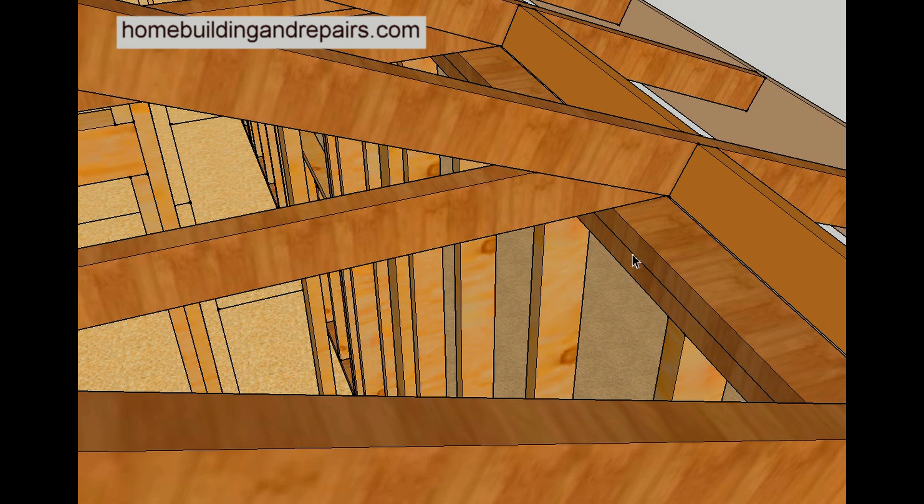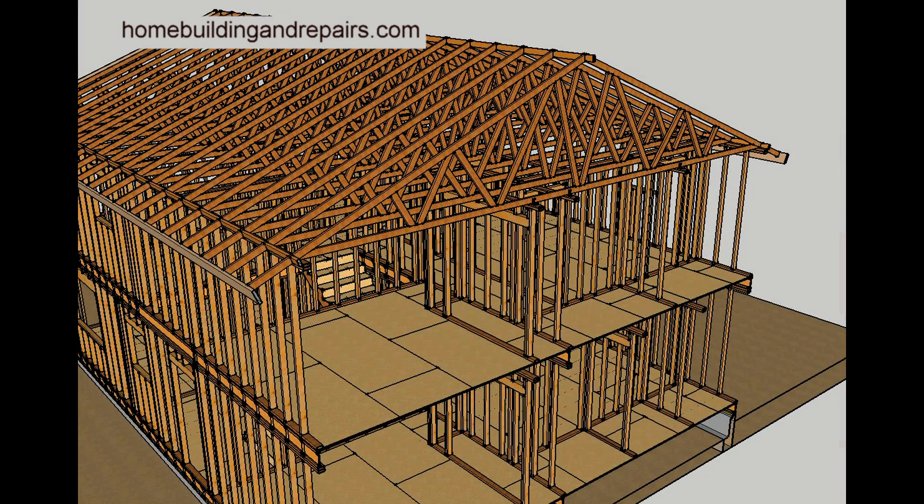So all interior walls need to be a little lower, and this would be specified on your framing plans. Here is a cutaway section of the framing. The roof truss sits on the exterior walls — these are the bearing points where the truss won't move up and down as much as it will in the center. We have the exterior wall, interior walls, and exterior wall. The roof truss sits on the exterior walls and the truss clips are used on the interior.